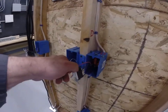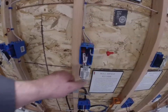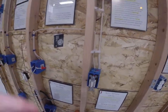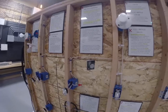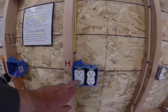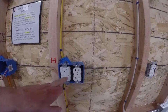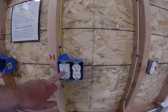Then we have what we call turning on lights from multiple locations. We have a three-way, a four-way, and a three-way, and we're able to turn this light on from three different locations — circuits that you're going to learn how to wire when you come into lab. We also have another kind of circuit called the ground fault circuit interrupter circuit. This particular receptacle becomes protected by this receptacle.